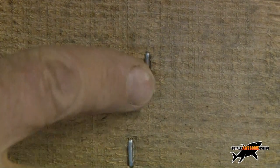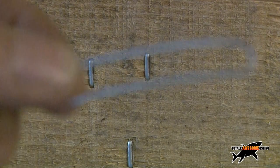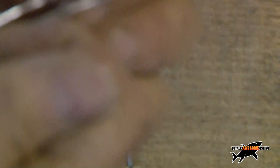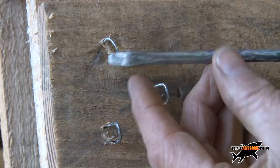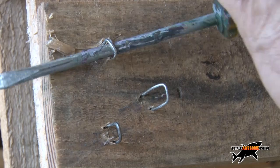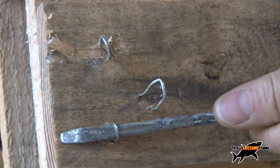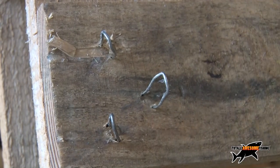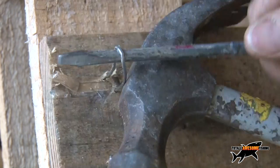There are the staples - quite long, about two inches. I'm going to use a screwdriver underneath there, just narrower than a staple, drive it underneath, tap underneath, and lever all these staples out. Out they come without splitting the wood. If I just put a crowbar on this, I'm going to have some real trouble. To increase leverage, just use the hammerhead as a lever to change the angle - and they will all pop out.